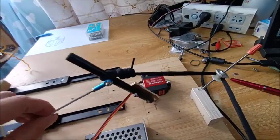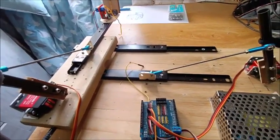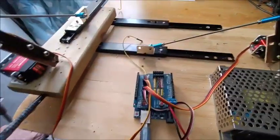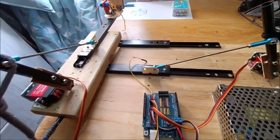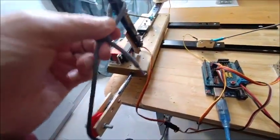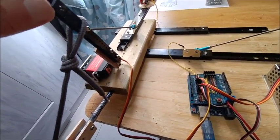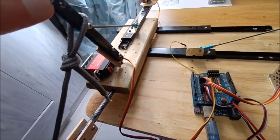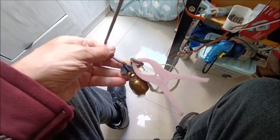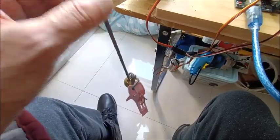Just some linkage that I had — I had all of this stuff. The only thing I had to buy was the drawer slides, so basically this printer cost about $6, but I already had the servos and the Arduino. I'm using a little counterweight to take up the slack, because one of the problems with using a servo rather than a stepper motor is gear lash — gear play. So I keep it tight by putting a counterweight on here. I made a little pulley extender just to keep it out of the way.